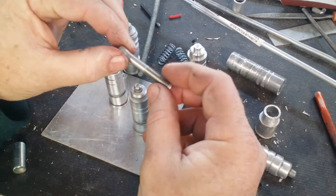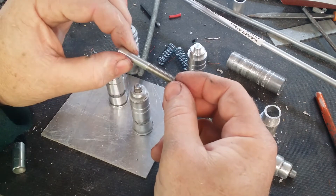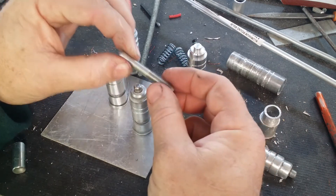The spring-loaded section is made from the inside piece of a stainless steel dynabolt. All I've done is cut it off to the appropriate length that I need and then screw on the nut piece and sand that down to a spacer so that it pushes against the spring.